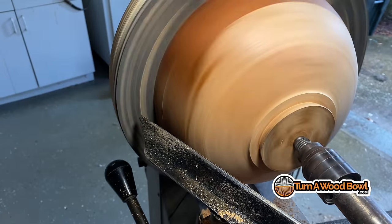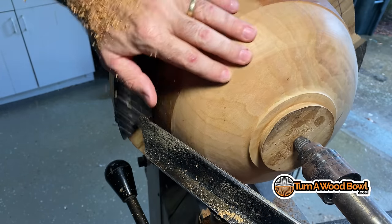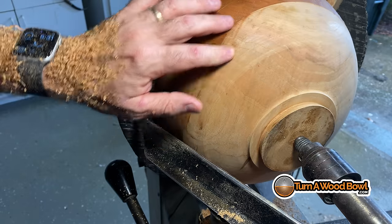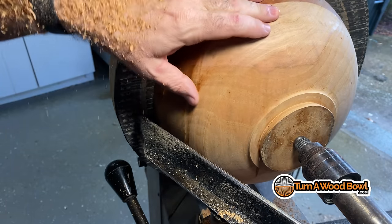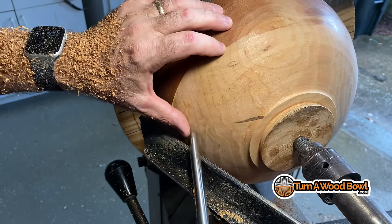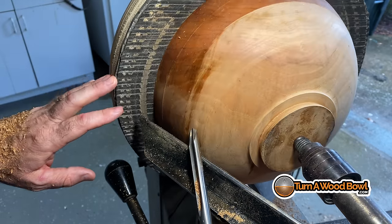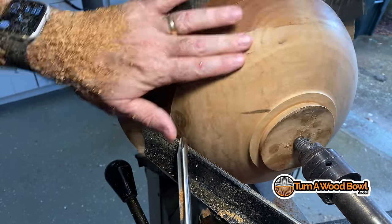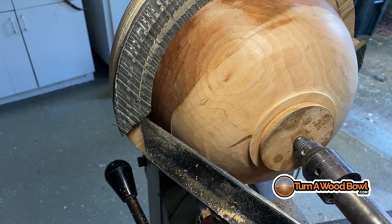Okay, you hear that bouncing or that clicking sound? On the side grain, we're making a nice cut, but on the end grain, we're making a cut because it's sticking out, so we're cutting that off. On the side grain, we haven't quite gotten down to it. So what's happening is it's cutting here, then it's coming off, and then it's coming back on here and cutting off and then on. That's what's making our clicking sound. So I gotta make a little bit deeper cut across here.